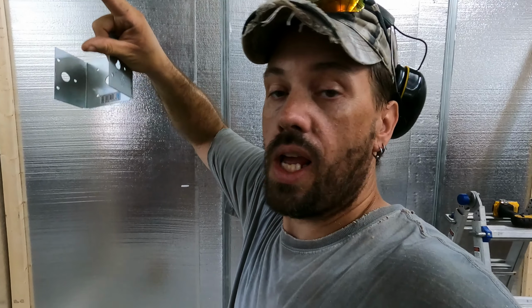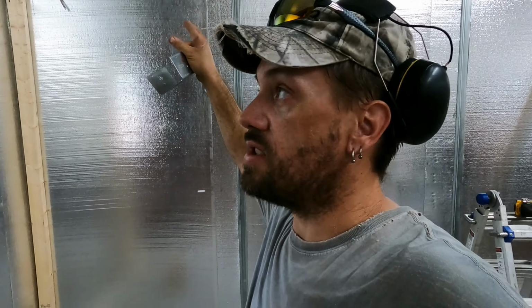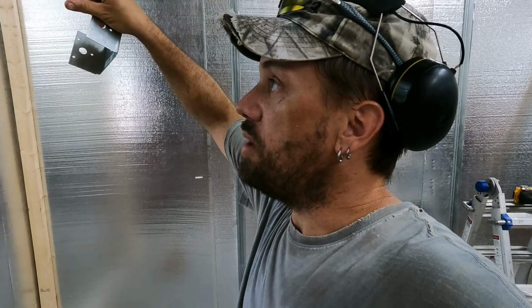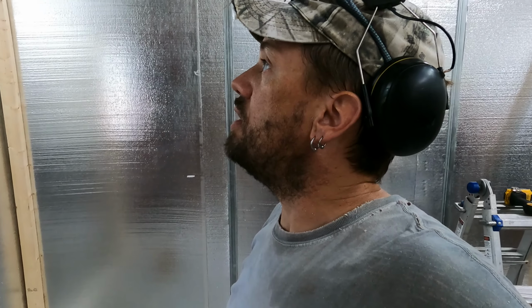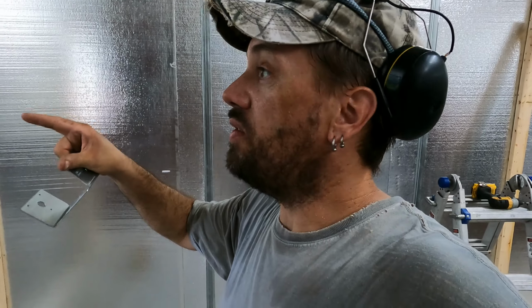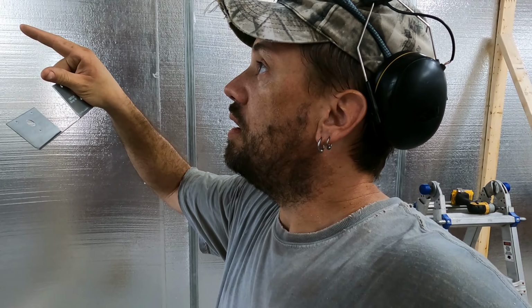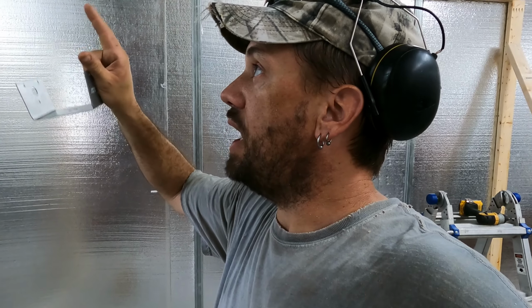So because I want the overhang, we're actually going to be coming down 6 inches, or the distance of a 2x6. We're going to be through bolting it, which I hadn't thought about. The through bolt's not going to fit right there. So we're going to set our elevation, but we're not going to screw this one in. We're going to anchor it to the building, and we'll come back to this because we're going to have to make our laminated beams before we anchor it to that. That shouldn't be too big a problem.